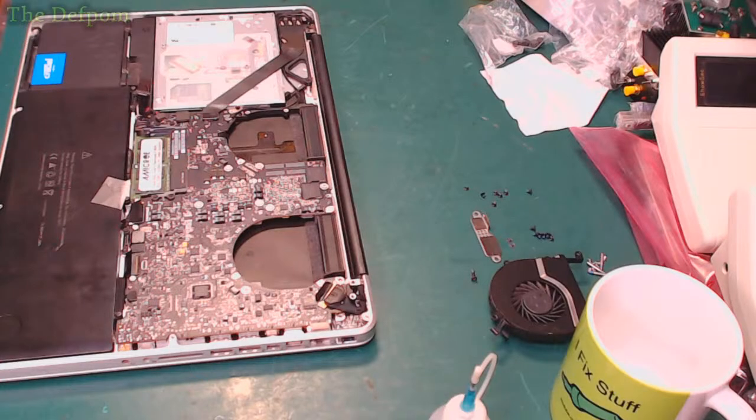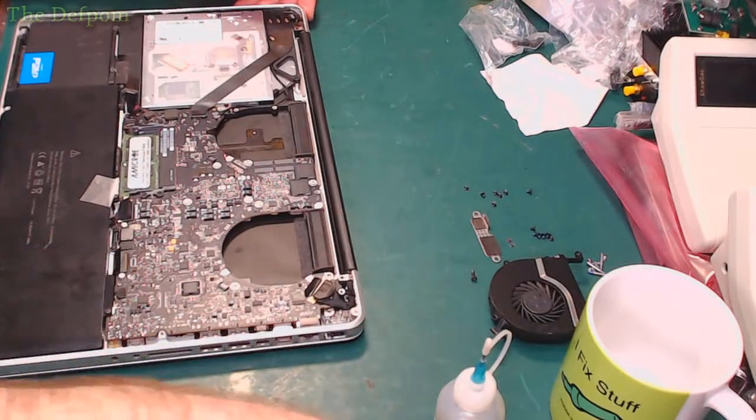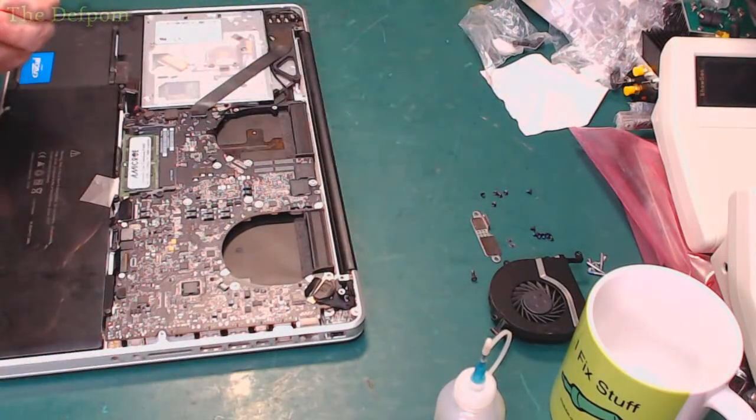No, I didn't use brightness controls because I'm not using anything newer than 10.12. So if you were wanting to use 10.13 or newer, then you have to add those wires in from the board as well, so you control the brightness through that board because it bypasses the original circuitry. So yeah, you're right there, Richard. But in my case, I'm not using anything which requires the brightness controls to be updated. 10.12 is fine, it works fine. It's only 10.13 onwards which has the issue with the brightness controls. Screwed down.